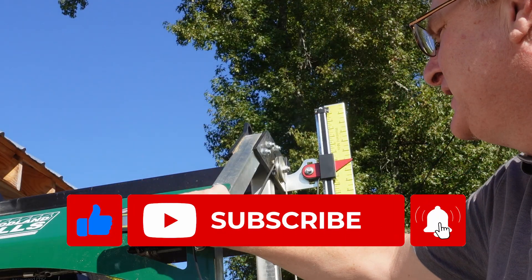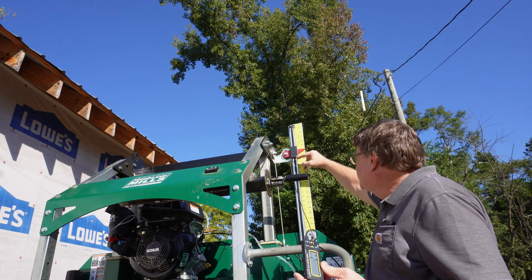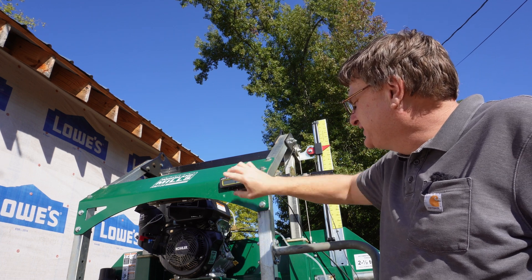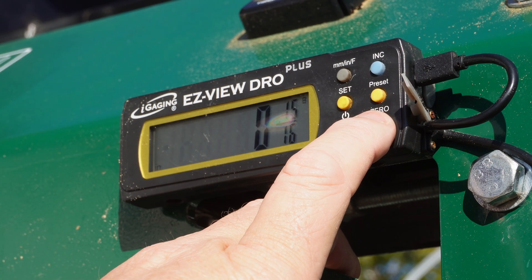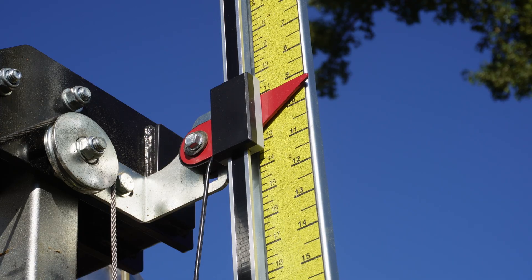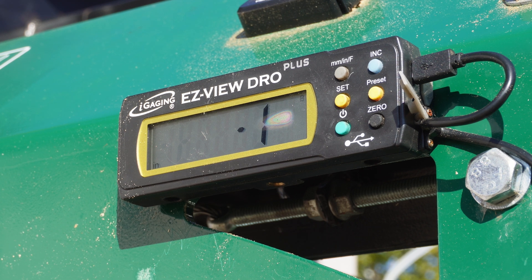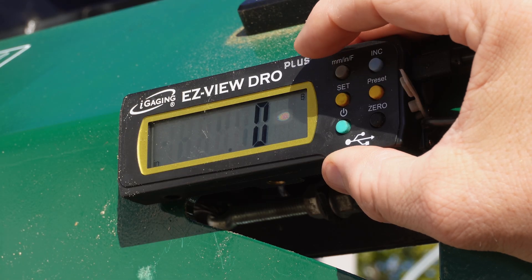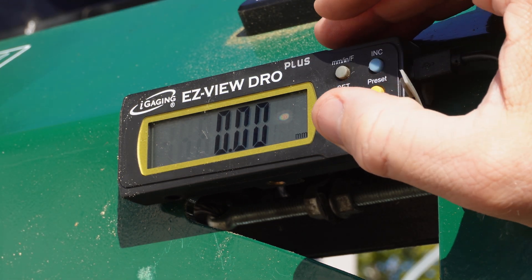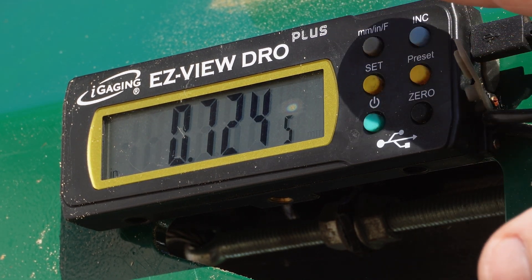The unit is magnetic and really all it has is this unit and then the measurement device stick. I'm mounting mine right here on this little indicator. Normally when I'm cutting I just leave it right there — it's really easy to just hit the zero button and then from there it'll allow me to lower. If I want one inch exactly, it's right there: one inch. This particular model is the Easy View DRO Plus. I'll leave a link in the description below. You can choose from millimeters, inches, and also fraction inches, just like we know it in the US.